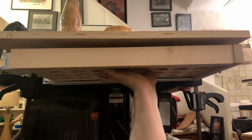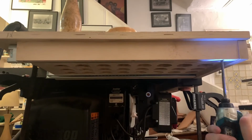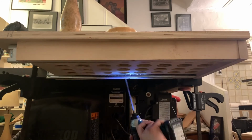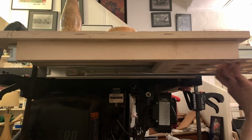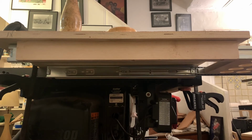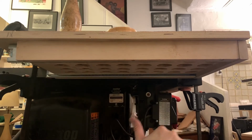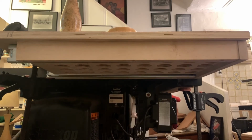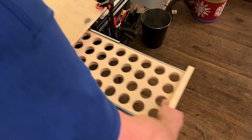So what you do is you get underneath that cabinet. You can hold it in place with one hand if you're really skilled, or get some clamps if you're really smart, and just use 6 pocket screws to mount that thing into the cabinet. Make sure you use the appropriate length screw so that you don't go all the way through the bottom of your cabinet. Look at that motion. That's awesome. You did good, buddy. Good job. Oh, look how fast he got off the ground. That was in real time, no editing.